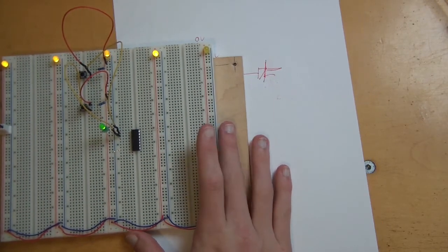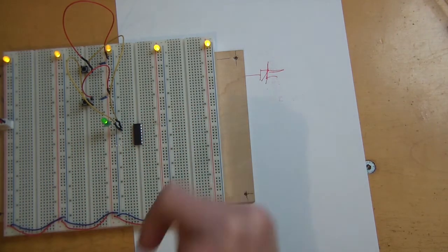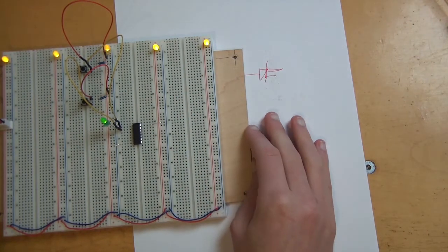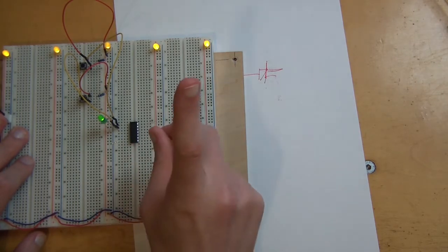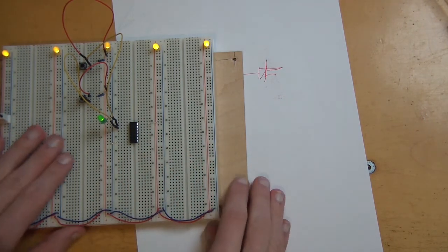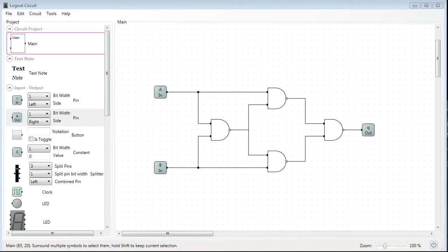But what I will tell you is how to build the one logic circuit we haven't seen yet, which is XOR — and this is the circuit we will actually use to add two numbers to each other. I can't draw the circuit diagram of XOR, it's too complicated, so I'm going to show it on the computer. An XOR gate is made up out of four NAND gates — those are all four gates we have available in our 4011 chip.